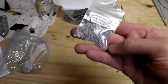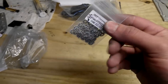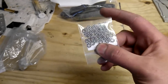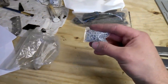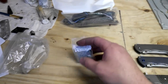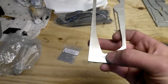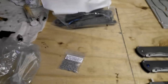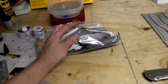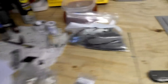Right here are all the ceramic bearings. The dear sweet apprentice sat here and popped all the 440C balls out and replaced them with ceramic balls. I did a couple and I was like, this is a job for the apprentice. We ended up making a little plate for it so you can dump the balls in and scooch them over into a pattern to pop it around a little faster. It's definitely tedious work, and that magnifying glass came in super handy. This bag right here is actually a bag of carbon fiber inserts — just got it from WaterJet today.